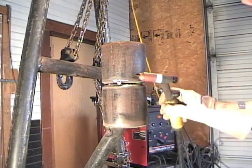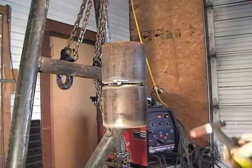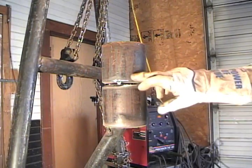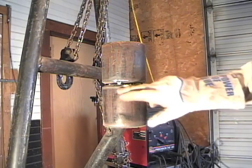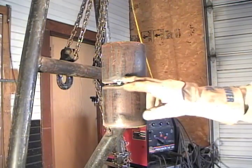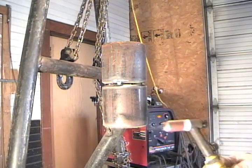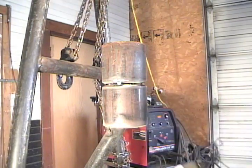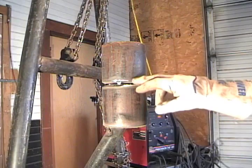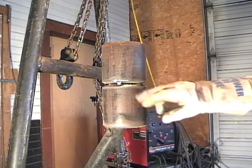You're just going to walk the cup and roll your wrists. In the bevel you can really just slide around because the surface is shined up well. I've actually taken a piece of soapstone at times and used it on a rough surface like the outer part of the pipe where it's not real shined up — it makes things slide a lot easier and won't hurt the material. It's made for marking metal. But the inspector will knock it out if you grind the surface, because they don't want you taking away from the surface of the material. That's a no-no.